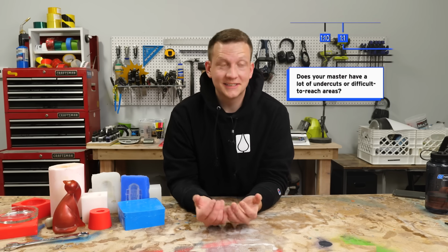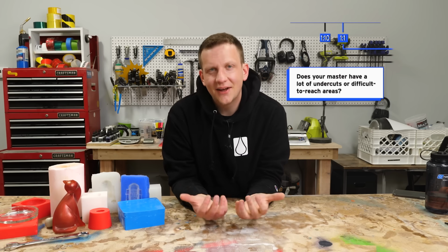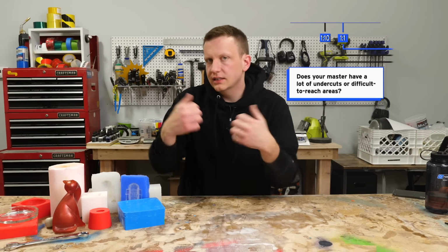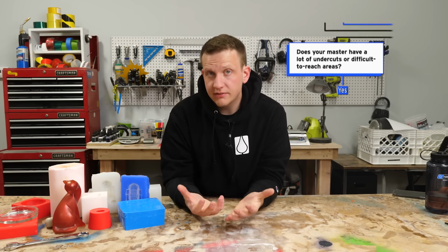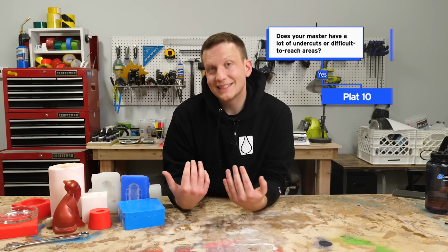Hey, that's almost the exact same question from the high strengths that we talked about over there, because it's another factor to consider. Just like before, a hook like that's going to need a lot more flexibility than something simple like that glass tray I had before. If you have a lot of undercuts and you need that maximum flexibility, we're going to recommend Plat 10.